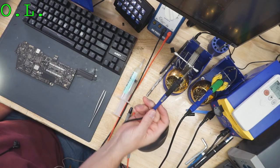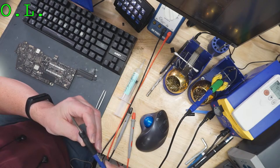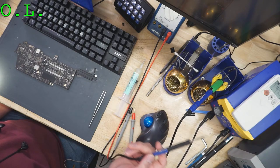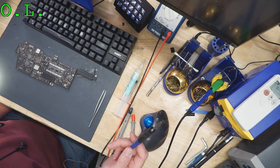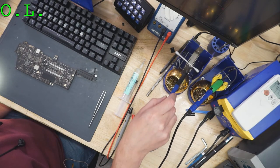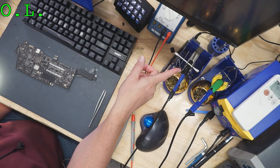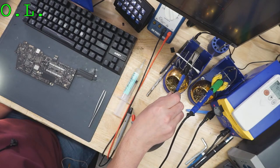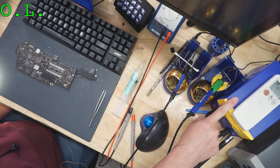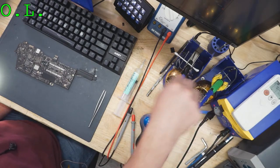And then the micro handpiece, FM2032, and this is the T30KN micro tip. So you don't have to buy the big one. This big one's expensive, but you really should have both of these handpieces. And this is the stand for tweezers, and all you have to do is put a stick through them, and it'll hold the micro handpiece just fine. So if you want to use the tweezers, go on this tip, and it also adapts easily to the micro handpiece. But you can get just the FX951 instead of this big one, and then just have two tips that you unplug and plug back in whenever you use them. Because you want both of these tips for working on stuff.